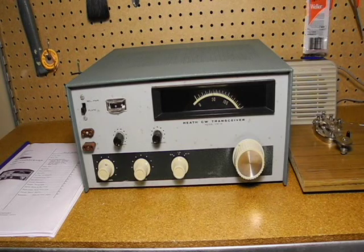While designed primarily for the Novice class license, you could increase the power and use an optional VFO once you moved beyond the Novice class. Its main limitations were that it was CW only, with coverage of only three bands — many other radios covered five or more HF bands. It had a simple matching circuit with a limited ability to match to antennas. The meter is very small and the side tone has a rather ugly sound. The transmitter is crystal controlled unless you have the optional VFO. It receives CW only, and is a basic receiver with no automatic gain control, noise limiter, and no adjustable VFO.